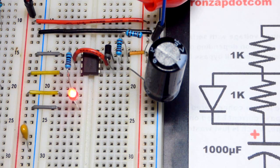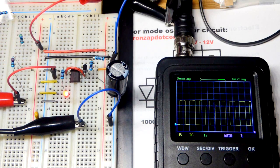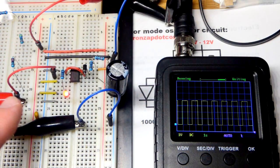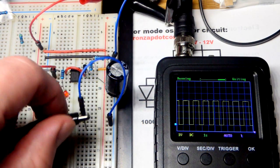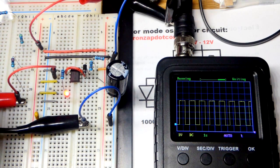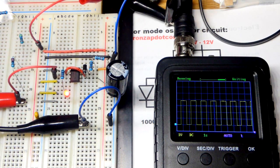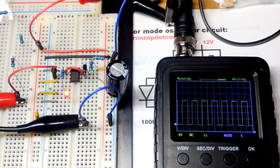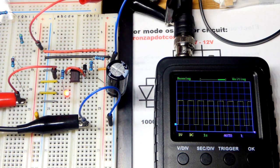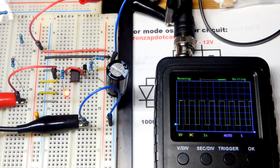We take the same 10 nanofarad capacitor, connect it to the rail, and you can see it looks like it took care of the problem there as well. Now we can get the oscilloscope to look at this and also look at another problem we have. I have one of my pocket oscilloscopes here with alligator clips coming out of the plug. I clip them to jumpers and stab them into the board - they hold up pretty nicely. There's a red one and a black one. First let's look at one problem - there's the waveform.